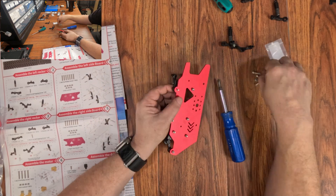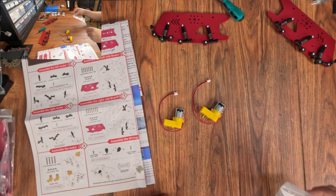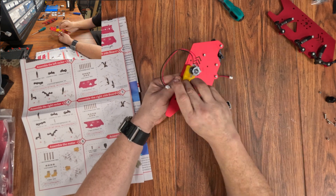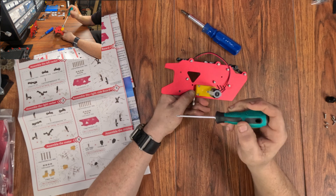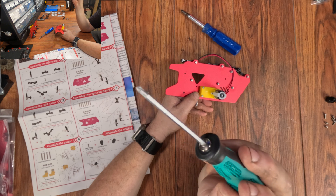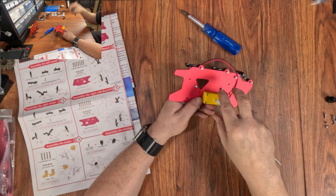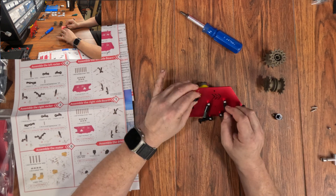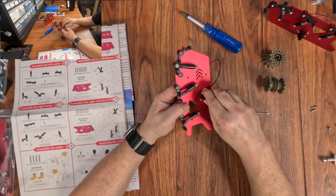With the suspension done, let's move on to steps six through eight: the drive motors and the wheels. These motors seem pretty heavy duty, and at $130 they better be. They're geared motors, so I guess this thing doesn't have variable speed — we'll save that deduction for later. They go in with just two nuts and two bolts. Next, the shaft adapters — these let us mount the drive wheel to the motor. Super easy, it slides over the motor and two set screws hold it on.